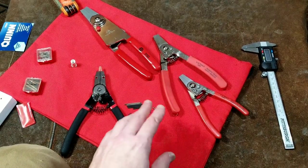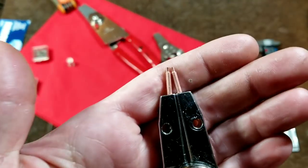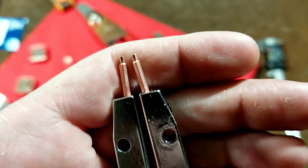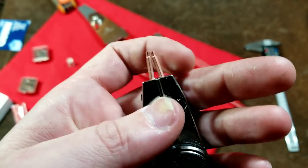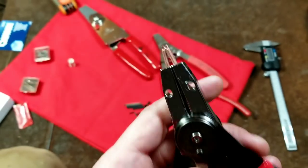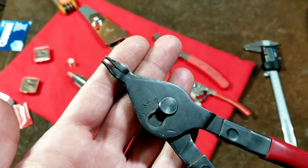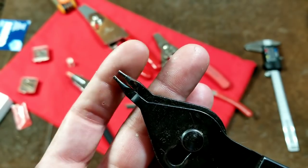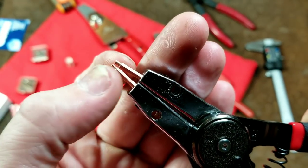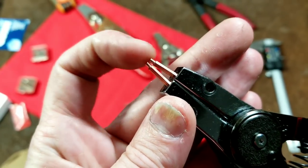The Harbor Freights come with five sets of snap ring pins, including a straight set of large-diameter pins. One of the reasons hex pins are so nice is that when you use snap ring pliers, the edge will often get worn out and the snap ring tips will slip. On simpler pairs you have to grind them down to get a new sharp edge, but with hex ones you can just rotate them to another flat — a 60-degree difference — and have access to another sharp edge.